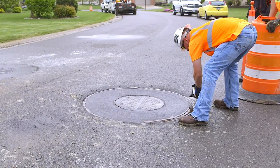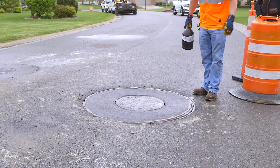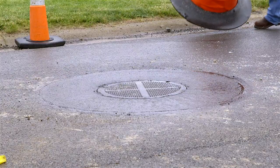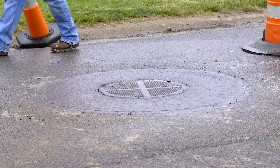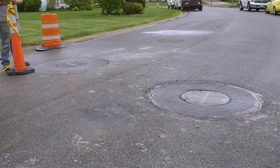There's a pourable sealant that's applied that seals the interface between the repair and the existing asphalt, keeping water from penetrating and causing any damage to the surrounding pavement. Normally your crews will repair five to ten manholes contiguously — all in the same location — which is the most efficient way to operate. Doing that, you should be able to complete about ten manholes per day in an eight-hour day. When this process is entirely completed, you have a watertight, vacuum-tested, adjustable repair that will last for many years.